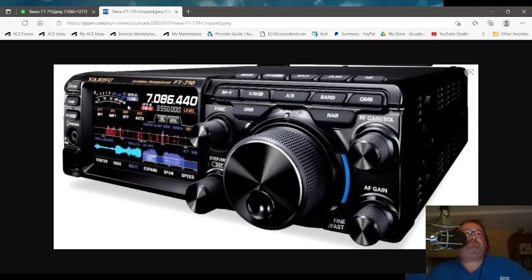Kudos to Ten-Tec in 2003. Pretty much down conversion went away in the late seventies and everybody went to up conversion. One of the things I've warned about on the channel: don't get snookered by clever marketing that everything new is always better. In the late seventies they were marketing up conversion and it sounded wonderful, but it had its downsides. The down conversion gives us physical roofing filters that are sharper, better quality, and not as expensive as one would cost for 40 MHz and 70 MHz.